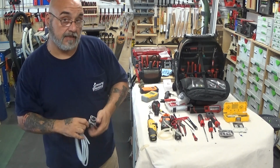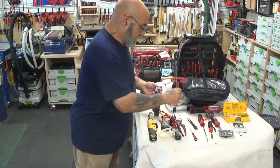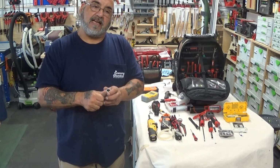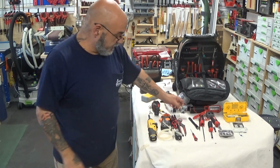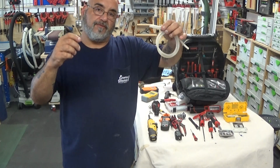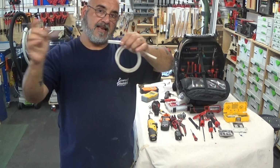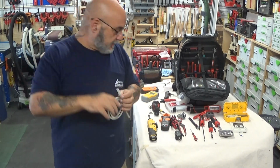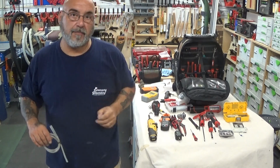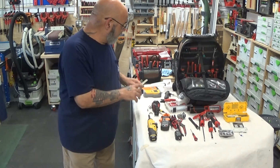On the newer tankless heaters, there's actually a machine screw in there. And that machine screw has kind of a little tunnel that sticks out of it. That's what this hose is for. This will fit over that little tunnel, make a seal, and now that's how you check your pressure. So it basically has almost a screw like that, plugging up the inlet, the outlet there.